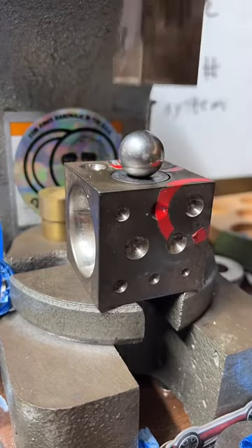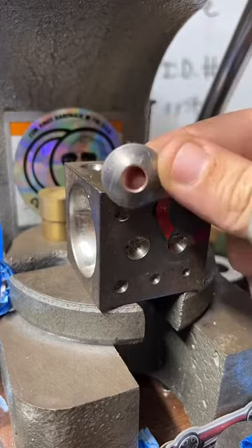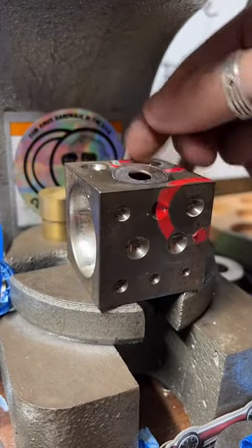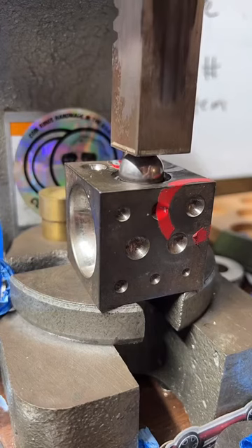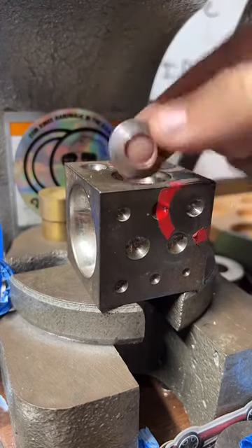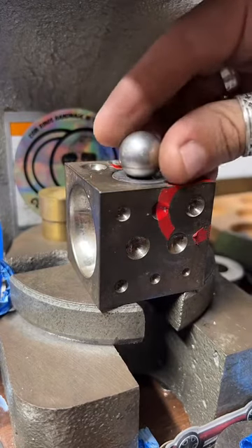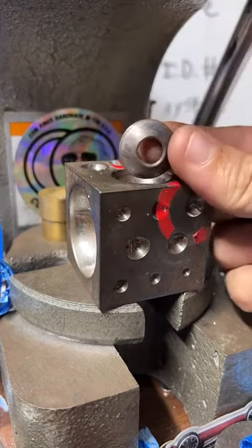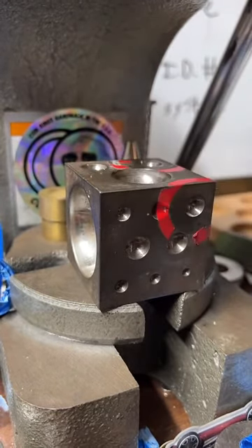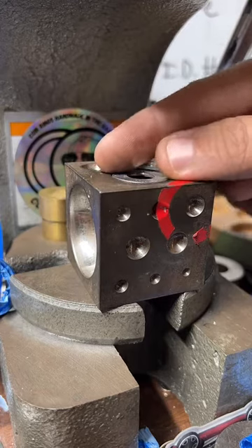Usually double-sided coins are magician coins. For a coin to be struck with double tail sides, it usually has to be double-struck, which means it's been sent through the machine twice — so you would have parts of the head and tails on both sides. So here's our different size punched quarters, and we're just going to start folding these and hope they don't split. The bigger it gets the more kind of round-shaped it gets, but that's not really a problem. There is our smallest one — that's going to make the widest band and it's going to be the one most likely to stretch. I usually make the center punch into keychains as an option when you order a coin ring.